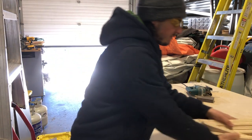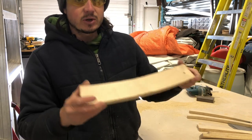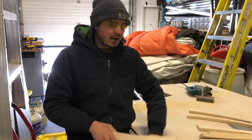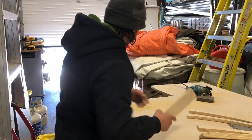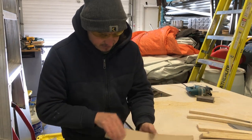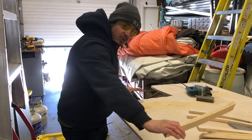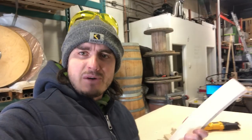These are the connection pieces for the compact circle archway — they'll go at the back so you won't even see them. A couple of tips when cutting plywood: first, there's going to be a good side and a bad side. The underside of the jigsaw cut is going to be clean; the top side is going to be rough. So the front of the archway should always be the nicer side. Furthermore, try to cut with the grain lengthwise — that creates a smoother, easier cut. Highly recommend that.